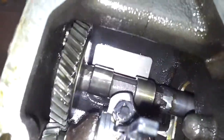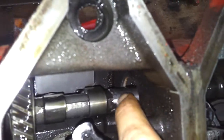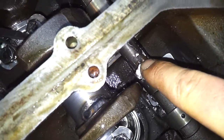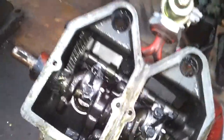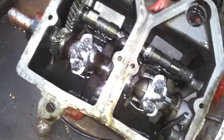The camshaft is the same sort of job — there's a little collar welded all the way around and then ground off right there so it wouldn't interfere with the cam follower. Works pretty well — revved the nuts off it and they're still here.